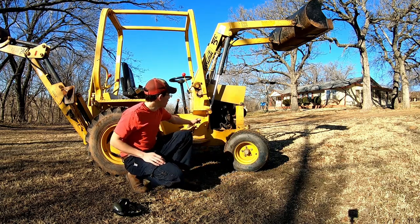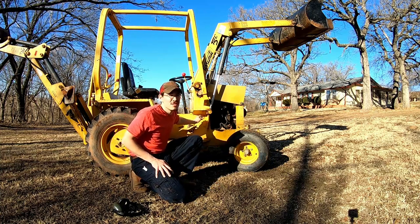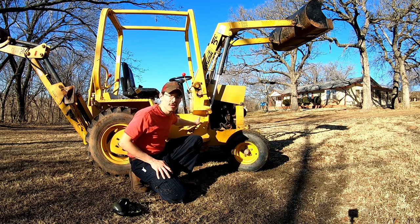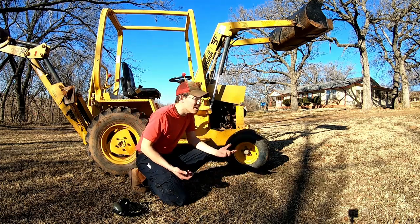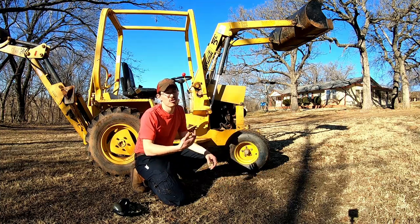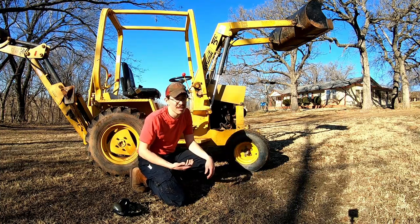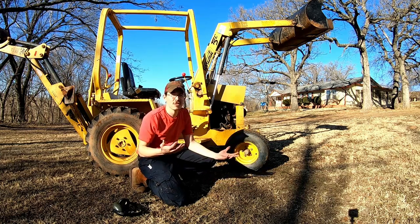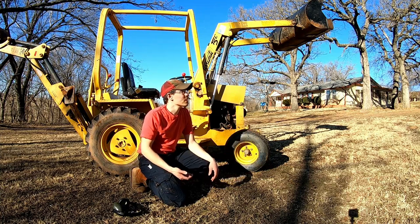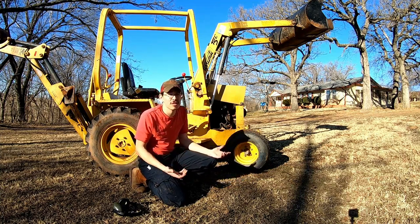So really, when you come to a hill and start slowing down, slow down with the pedal as well. Don't keep flooring it. That's just gonna groan and it's not gonna help. It doesn't make the machine really go much faster. So what you need to do to get more power on a hill is you back off on it so that you're not trying to go as fast. That's like using a lower gear basically. So that's how this transmission is made to work. And I find that it, for the most part, does that.